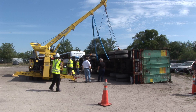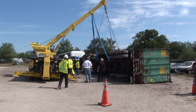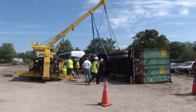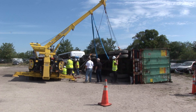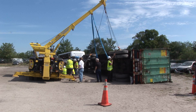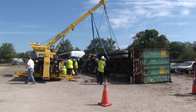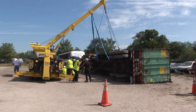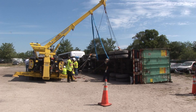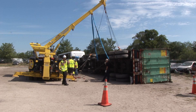This is the overturning moment. What we will be doing is using the second winch to carry as much load as we can from this part of the vehicle. We tied up on the top corner of the container, ran a chain on top of it on a wood block to spread the load on the wheels, and used three snatch blocks. We will pull the container and transfer pull as low as possible on the ground and as close as possible to the vehicle, causing less overturning moment and stabilizing the vehicle.